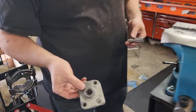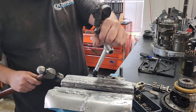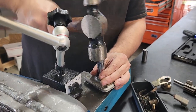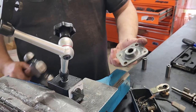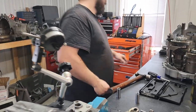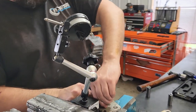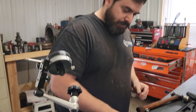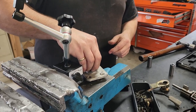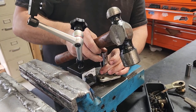You can see the bearing is now quite proud. Drive it back until it contacts the bottom flat surface. Grease this when you put it back together — I have a little transmission fluid on my finger here, but you can use assembly lubricant, or even motor oil is fine. Take your new seal, put a little grease on it, and seat it in. A 15 millimeter socket is going to work a little better to drive the seal in — just use anything that doesn't mash the inside of the seal.